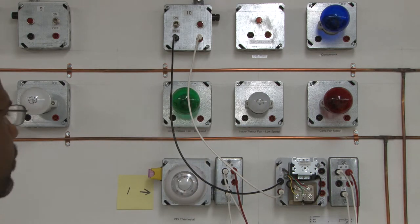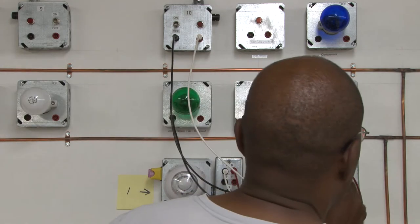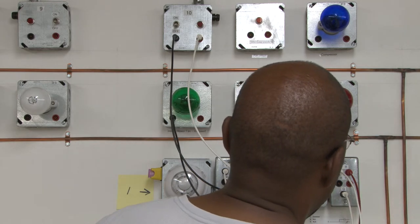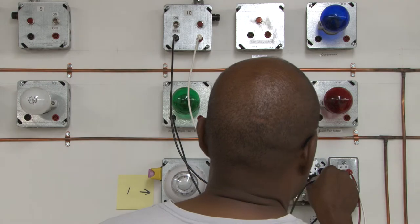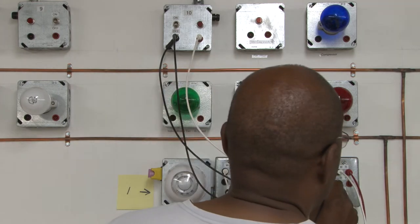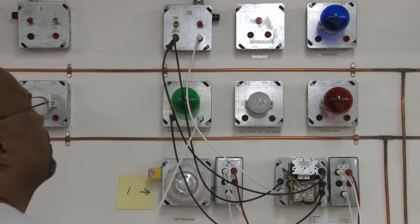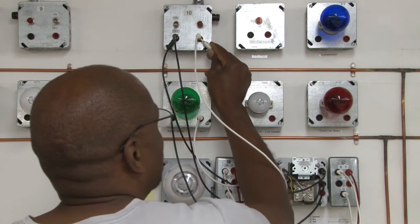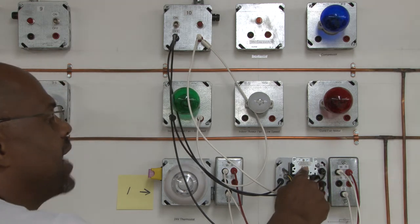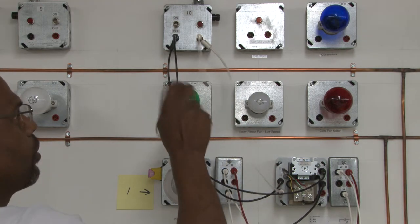In this case, we're going to go to the light bulb and we're going to connect it to the common side, the normally open side. When it becomes energized, it will power it up. So we're going to go to the power source, come out of the normally open, go to the light bulb, then we're going to take the other side of the light bulb — which is 110 on the neutral side — and go to the power source. Basically, we wired the relay contacts in series with the load. The neutral goes back to the main source on the neutral side.